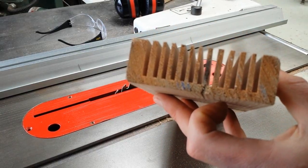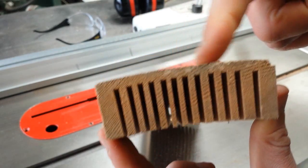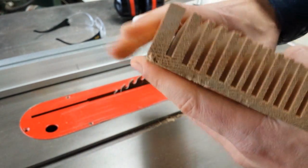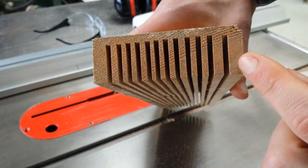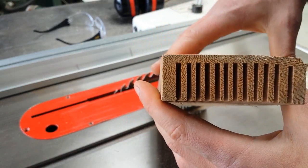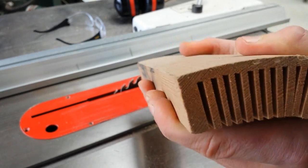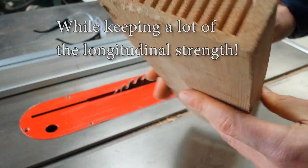So this is what we're left with. As you can see I can now flex it — I can adjust this surface with really not much pressure; I'm able to twist the board much more. The obvious downside is the weakening of the board. But if you imagine that area was filled, to get that amount of movement this top layer would have to expand so much that splitting would happen way sooner. You can actually get a very tight arch without splitting — so you get way more movement by relieving the stress this way. It kind of looks like a wooden heat sink.